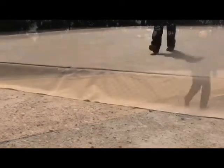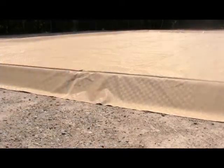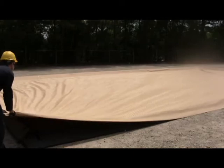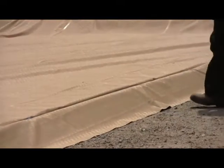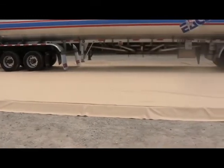The rugged liner material for this Ultra Containment Berm is a textured, slip-resistant PVC material that is available in 38 or 54 mil thicknesses. With the liner material properly placed on top of the containment area and foam support blocks, place one-inch steel rod or rebar on top of the material and into the slots in the top of the blocks. This will help secure the material and keep it in place during day-to-day operations.